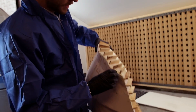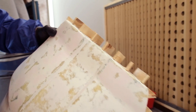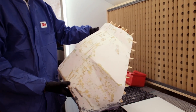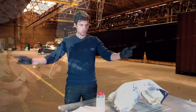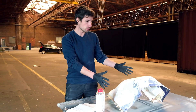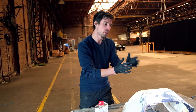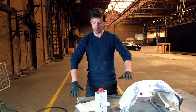The vertical ribs are done and we will put the flange on later, but first we'll put the top coat on, sand it a little, and when it's a nice shape we'll put the flange on. Now we do the top coat. We're preparing the spray gun to shoot the pattern coat — we'll clean the surface first. Do that before you start painting because you want to move quickly from mixing to spraying, as it can cure quite rapidly.